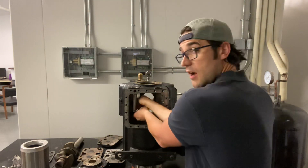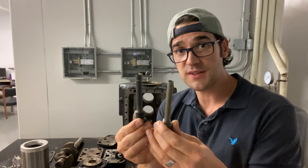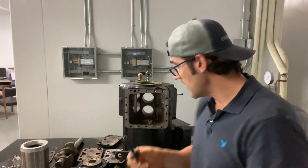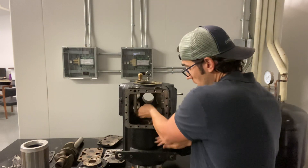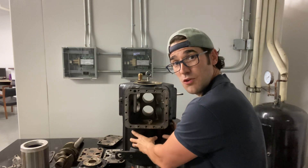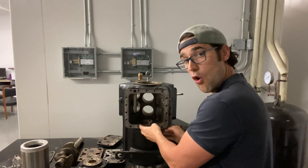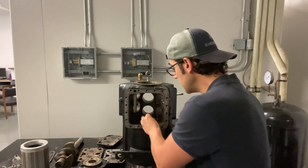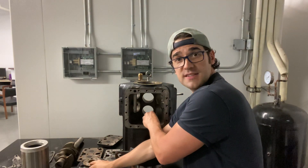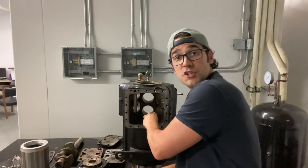The other things we talked about are the vent valves. There are two in the 6D compressors and this does a venturi effect and puts pressure inside the body — the motor compartment — making sure there's two PSI higher in here than in the crank. So oil flows through this free-floating check valve, so you're always getting oil into the oil pump, and the oil pump can feed the crankshaft and all the journals.